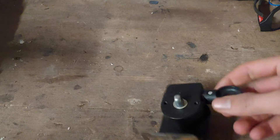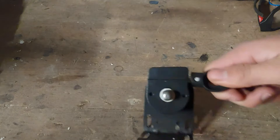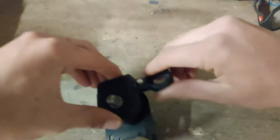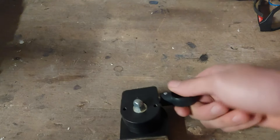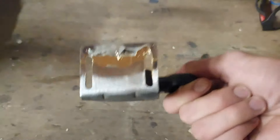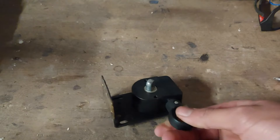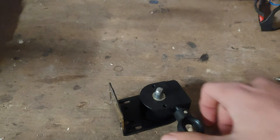This was a pretty easy repair. I haven't done that much bronze brazing before, but if you want to do this yourself you need a high heat torch — none of those consumer torches will work. I'm using the TurboTorch STK99, which works pretty well for brazing smaller parts. If you're working on larger parts you'll need oxy acetylene, but for small parts you can definitely do it with a good propane torch as I've demonstrated here.